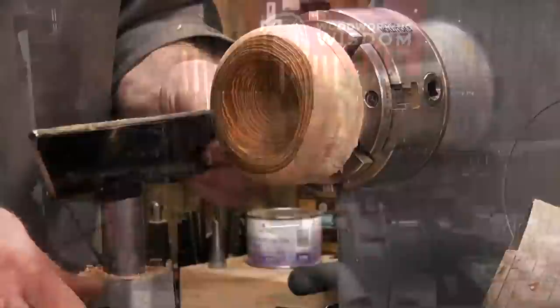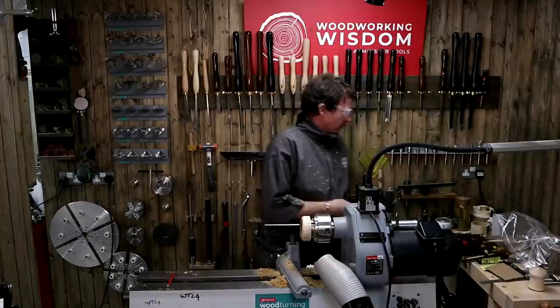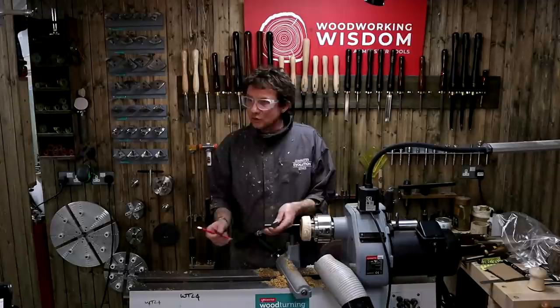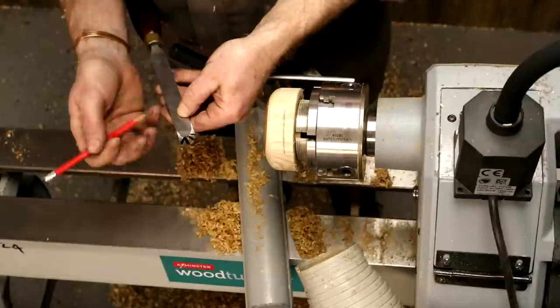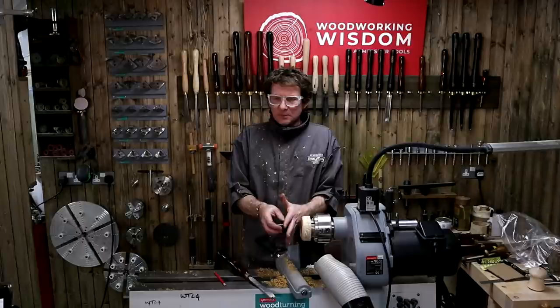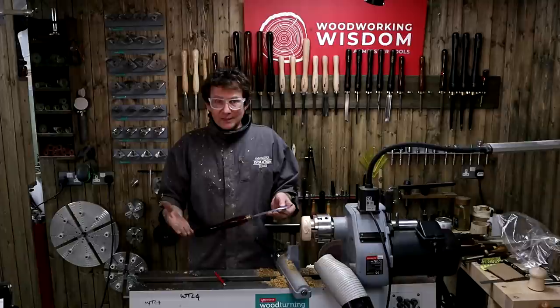Ben asks: are you only able to lift the scraper handle like that because it's a negative rake? Yes - a negative rake scraper. How does it make a difference? In reality you haven't got a cutting tip coming flat - you've got a curved knife edge coming up to the front edge, giving you a really sharp edge. This is actually sharp enough I can cut paper with it. I don't have a burr because a burr makes it aggressive - it'll bite. So therefore it gives a cleaner cut. Negative rake scraper has become very popular. My simple answer: more controllable. The fact I can drop the handle down and hold with fingertips makes it less scary.